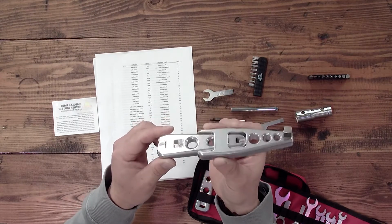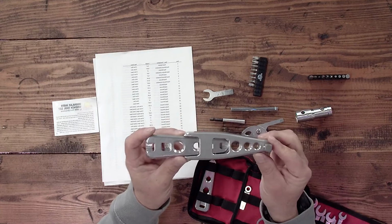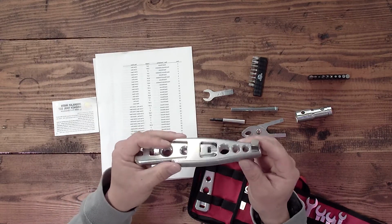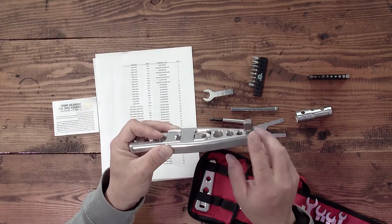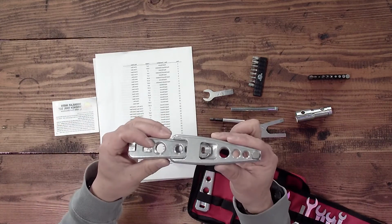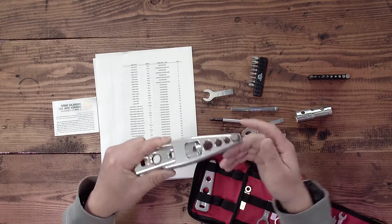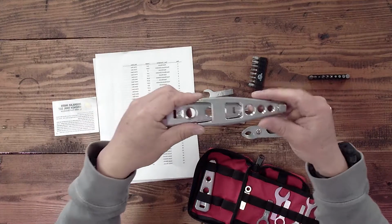And if I remember correctly, on his website, the gentleman who developed this, his name is Gordon East. Gordon East is his name. But I believe that with this configuration, he put over 150 pounds of torque, and you can see the video, and then he is able to pull this out. So it didn't bend this to where now you've got poor fitment here, and it didn't cause any issues here in this 1/4-inch drive. So that was with over 150, I think it says 152 pounds of torque. Okay.